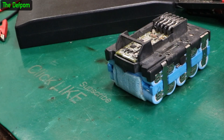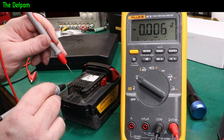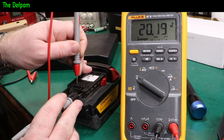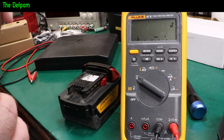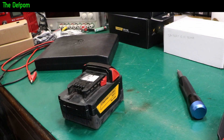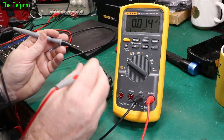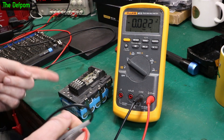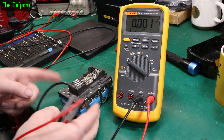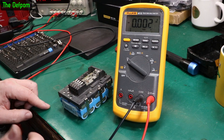I should actually do a voltage check. I realize now those two other terminals are the actual power terminals - I'm surprised those ones are really dirty. 20.2 volts - which is fine, that will definitely charge. So let's probe around - I'm still getting the flashing light issue. Also I should mention the cell I've been charging hasn't come up to equal voltage with the others - it still has an internal resistance of 16 milliohms, which is six or seven milliohms more than the other cells - almost twice as much. It's definitely weak.